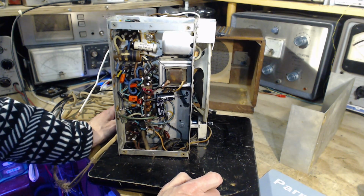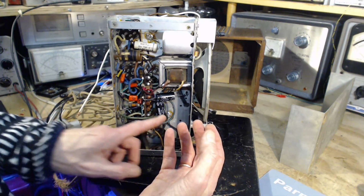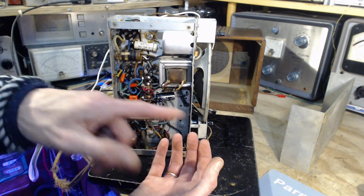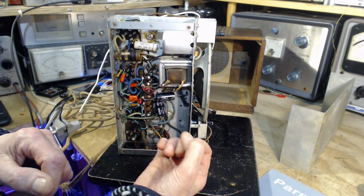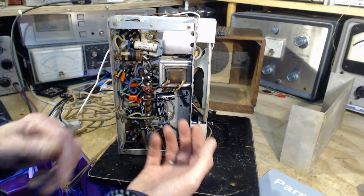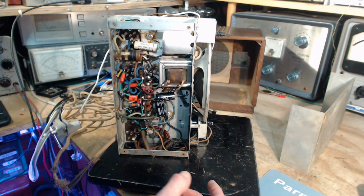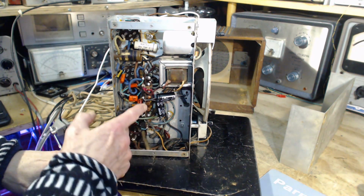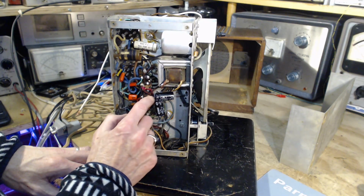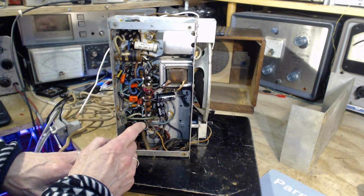Usually you have the big inductor, the big field coil, and then you have a capacitor on either side of it. In the newer radios, the capacitors get really big and the coil turns into a resistor, maybe a 30 ohm resistor or something like that. And then with that kind of filter you're depending on the capacitors to knock the hum out. So it's just kind of curious. It's definitely both positives tied together. The negative going somewhere else.